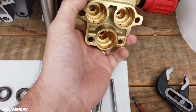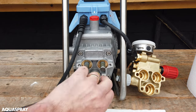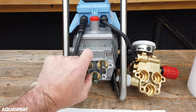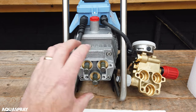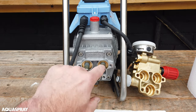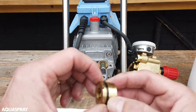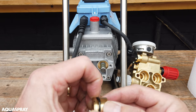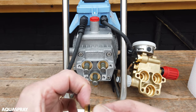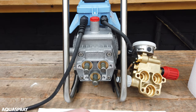These brass rings — if you're changing the water seal kit you shouldn't really need to take them out; they are just slid over the pistons. But sometimes you can't get them out until you take the housing off for the oil seals. They're just a spacer between the brass collar and the oil seal itself. The brass collar has a water seal in it as well, and there's an o-ring you can take off by just pinching it over the top of that lip and pushing it off with your thumb — do all three of them.